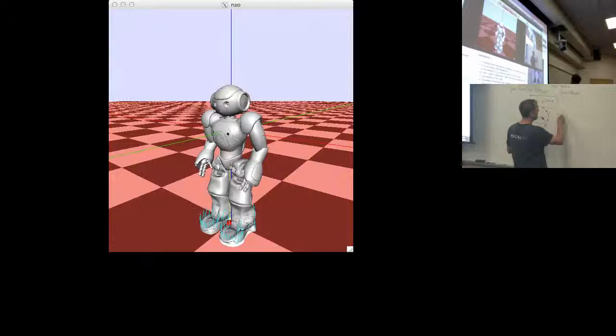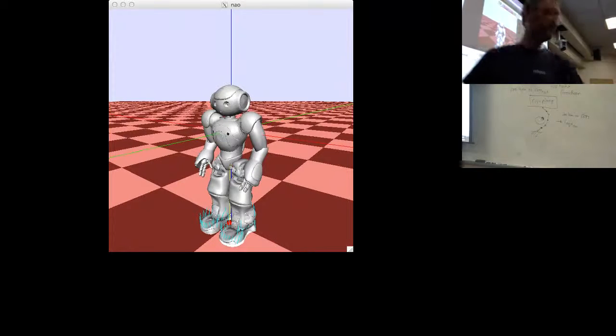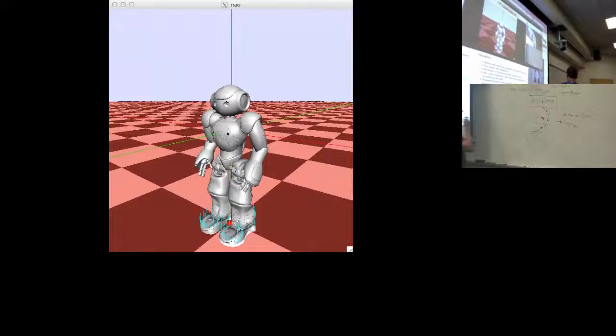So you basically do an inverse kinematics on the center of mass, and move the center of mass to a target position. And the target position is where the foot is. How do you figure out where the foot is? Well, we have some variables which are called card state. Again, I'll send you an email about these things as well.